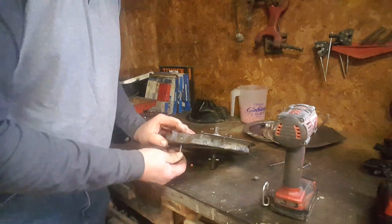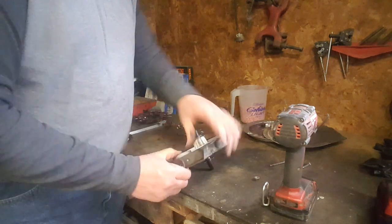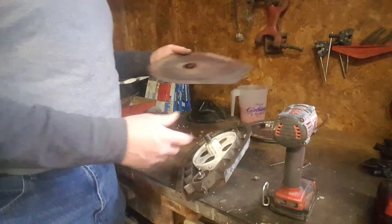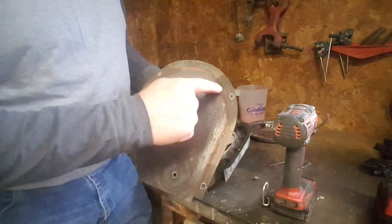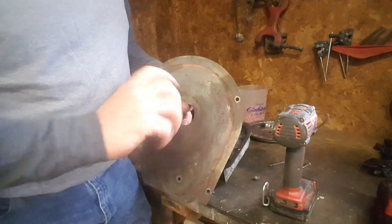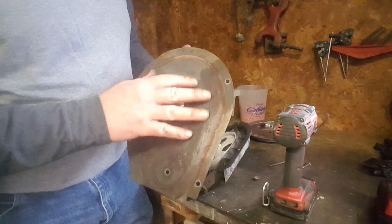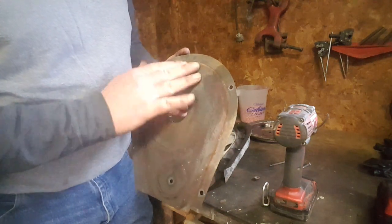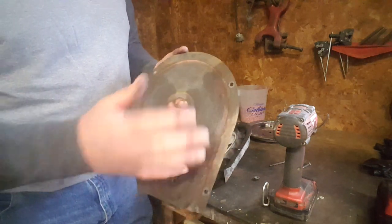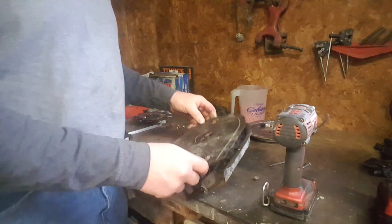Now we start rebuilding. With a 7/16 wrench and a screwdriver, you can rebuild these out in the field. We get to our backing plate. The Precision one has a softer material because the seed gets flicked against this tin - you can actually hear it hit. Personally, if you really like this one and it's in good shape, you could take some 80-grit or a flap wheel grinder, sand the roughness off and repaint it and reuse it. Or just get the Precision backer plate and it does a nicer job.